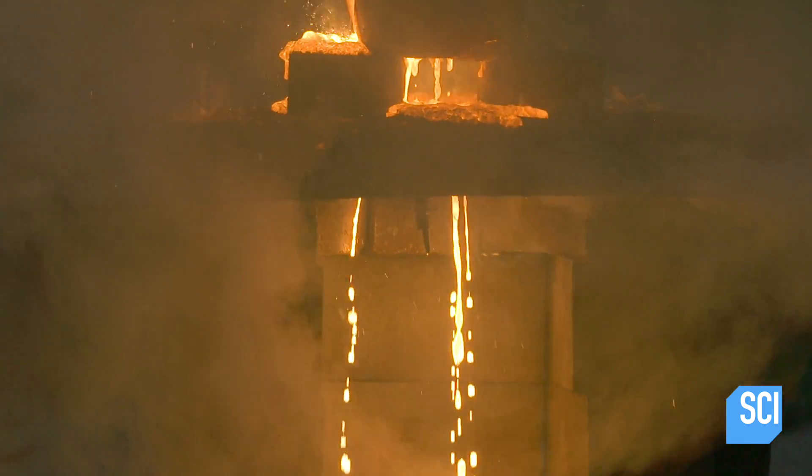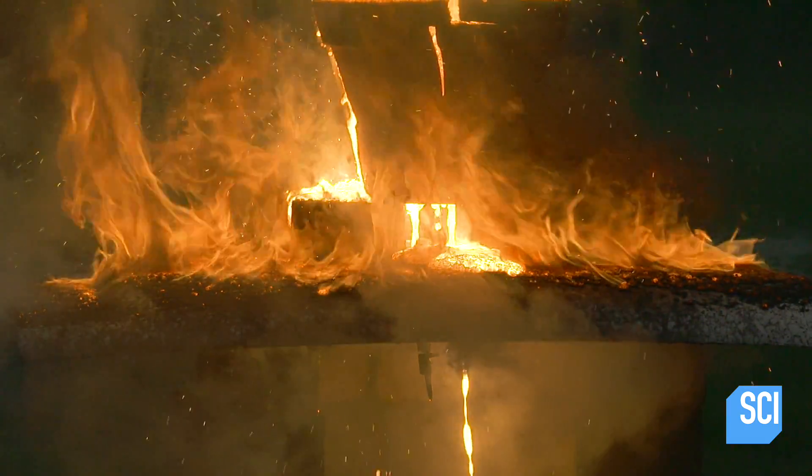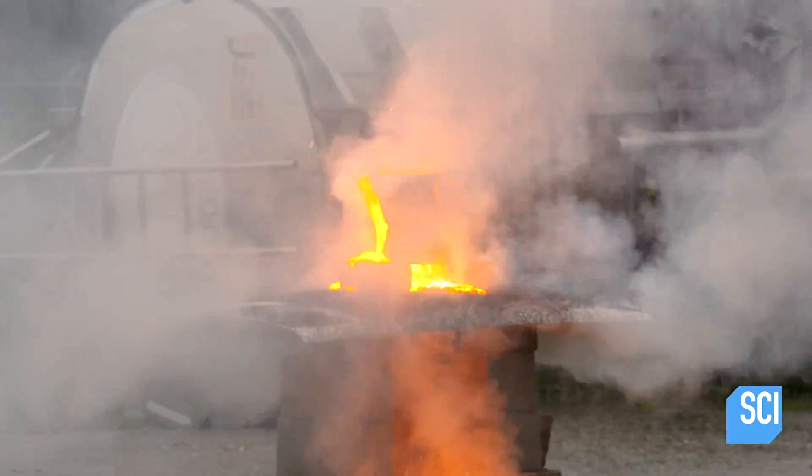It's also impressive that the clay pot and concrete don't melt. That's because as the reaction occurs, hot molten metal pours out of the hole, taking the heat with it. Also, since the mix is ignited in the middle of the pot, the thermite next to the clay pot is the last to light and protects the pot from the heat until the last moment.